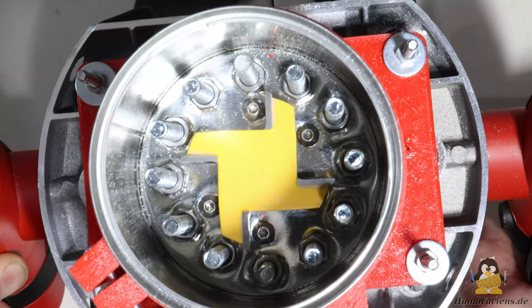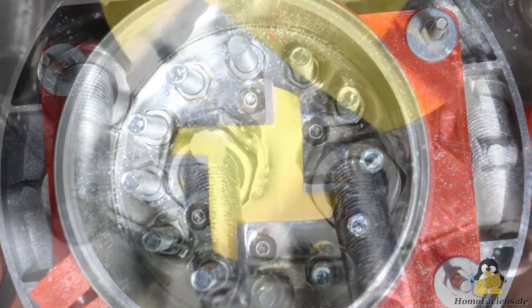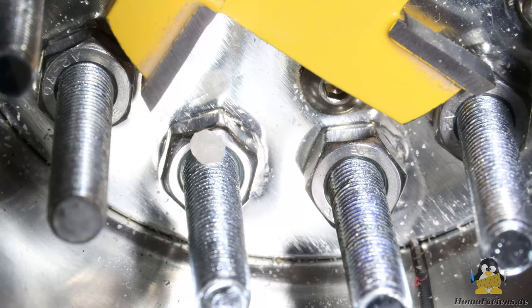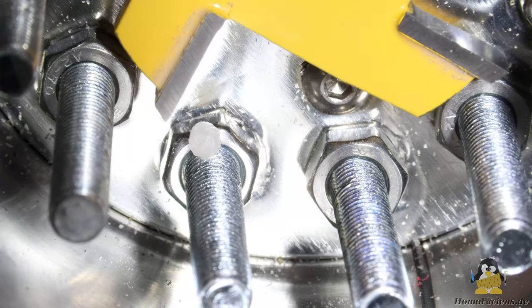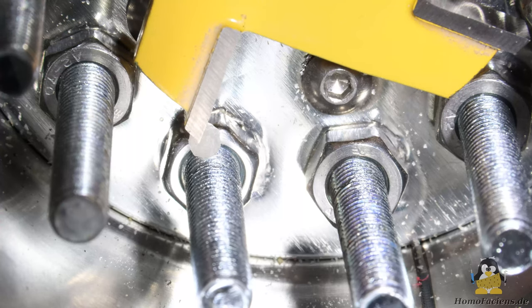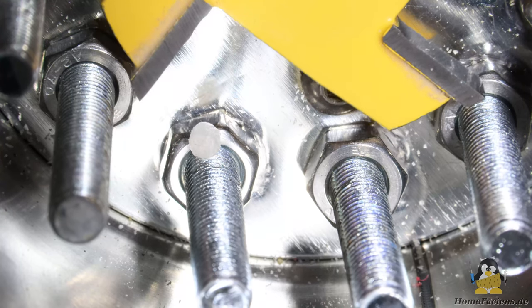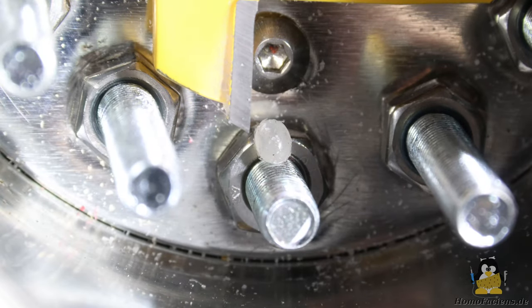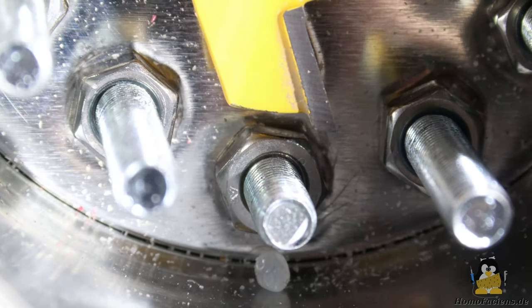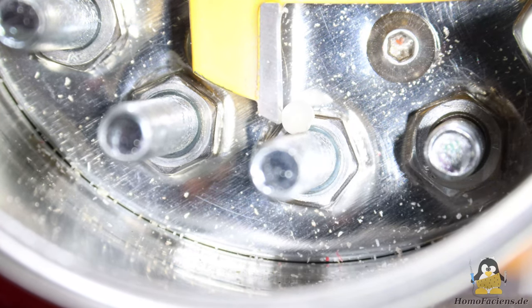As shown in the previous video, the pellets have too low a mass to be effectively chipped down to smaller particles with a rotating plate alone. Other processes take place in the grinder. If a pellet gets between the stator and the rotating plate, the particle cannot escape and is therefore hit with full force by the plate. This scrapes or knocks off material from the pellet. In order for this to work, the corresponding particle must be clamped between the stator and the rotor. If the gap is too large, the particle flies away from the plate just like in the blender without any material being removed. On the other hand, if the gap is too small, no particle can be trapped between the rotor and the stator.